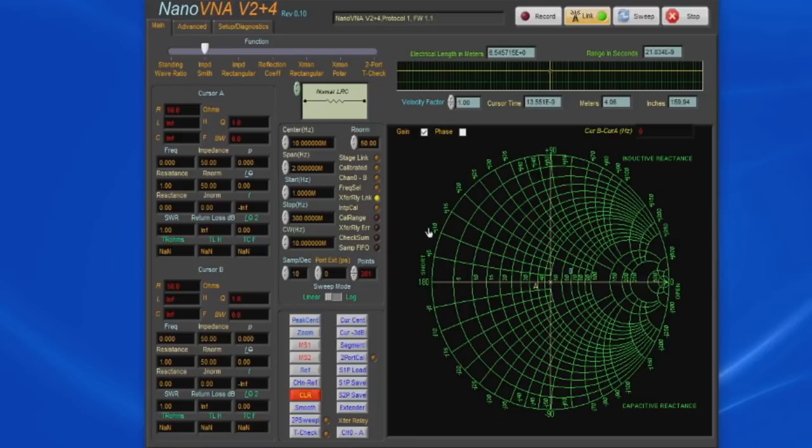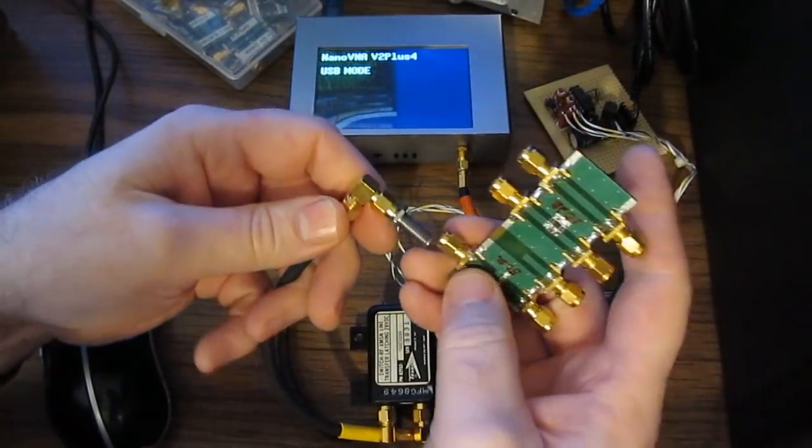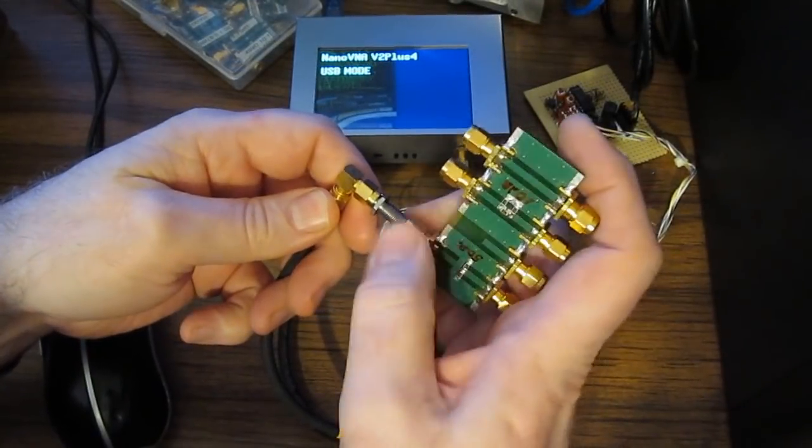So the software doesn't have a lot of error checking. If it's successful in opening the COM port that you've identified as being hooked to a transfer relay, it's fine with it. It's going to start wiggling that RTS pin. So it uses the CTS pin as a way to identify that the transfer relay is actually attached to that port. So now let's go ahead and attach a short onto port 1.